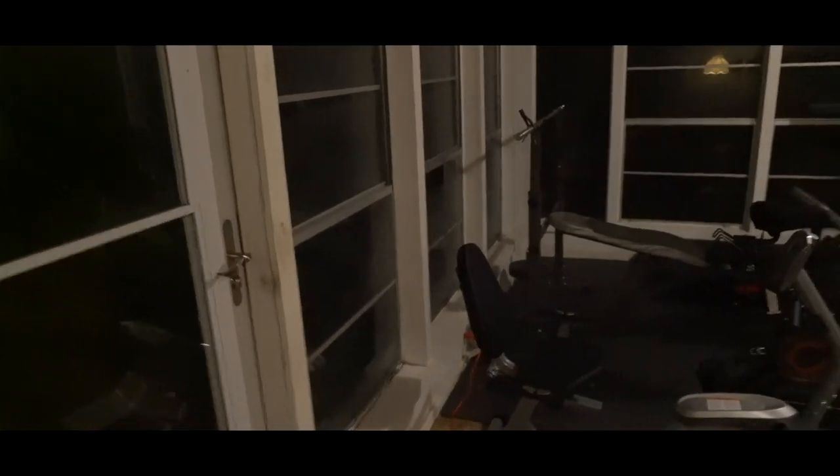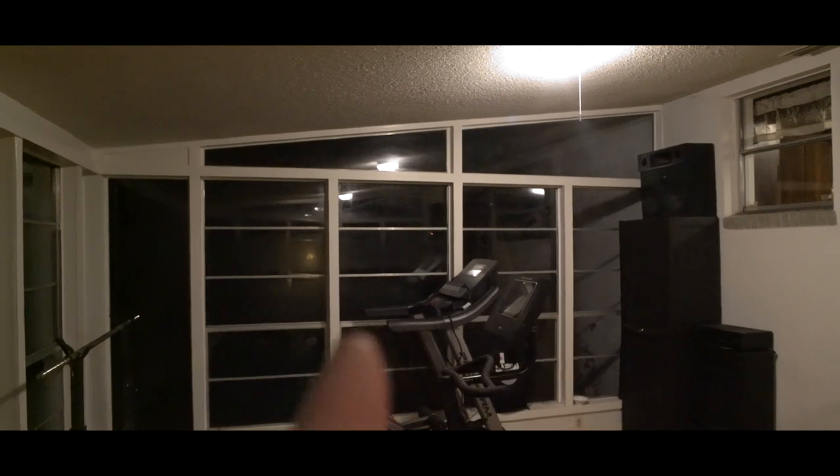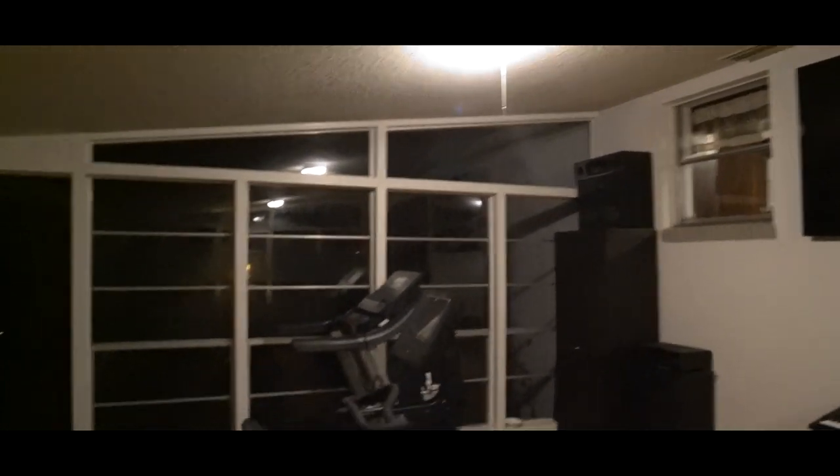Right here I haven't built the new threshold yet, but we're putting in a new door. Unfortunately most of these windows are going to go away because I'm making this into an actual room — eventually it'll be the new studio. I'm keeping the skylights up there because I like them. We're going to be insulating the walls and probably double-paning those windows up there. There's a company in town who can cut the glass for me. The floor came out really nice. There were some tricky cuts around the stairs — we had to measure and drill holes. I followed as close to the stairs as I could with a little gap so the floor can breathe, and we'll be trimming this up with baseboards. I thought about putting flooring on the step, but I like that the step has some grip, so we may just paint it with something grippier in a different color.